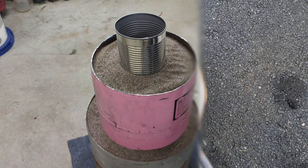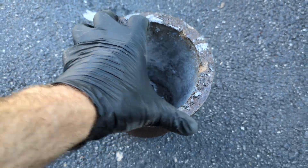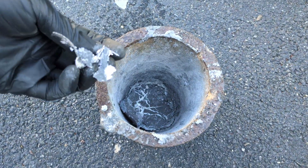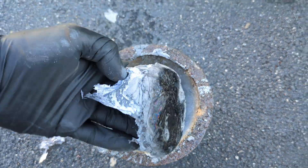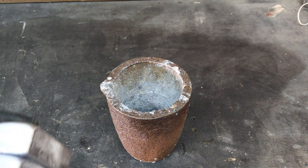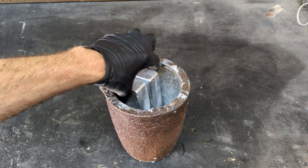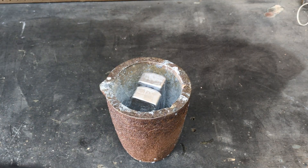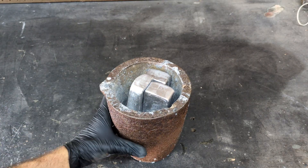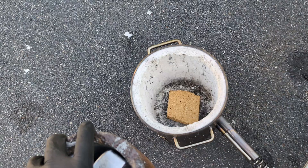When you're finished, you put a pouring cup on the top — this is going to contain the molten metal when you pour it in. Now that the lost foam casting mold is finished, I'm going to go to my furnace and clean out my crucible before starting. The aluminum is solidified from my last pour, shrunk and loose, and easy to pull out. We're gonna melt some ingots from my garage from previous casts — things like beach chairs, car rims, and other aluminum scrap that I pour into ingots.